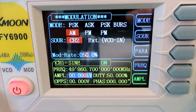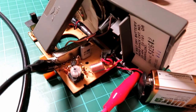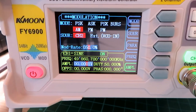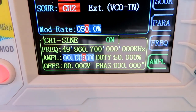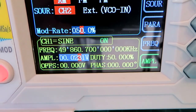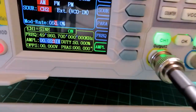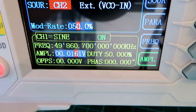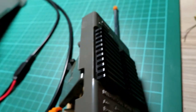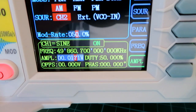I decided to check the radio sensitivity. Connected to the first radio — the one with the decent antenna — I'm putting quite a strong signal through: 21 millivolts going through a 30 dB attenuator. But it's only at that level that we just about hear the tone coming in. I could do the sums and tell you exactly how sensitive that is, but it's not really very sensitive at all — it's deaf as a post. It's not as bad as the second radio though. This is the typical problem with these toy radios: it's very often the receive that lets them down and not the transmit side.